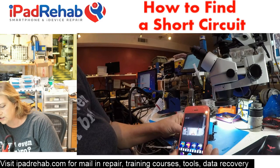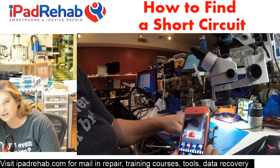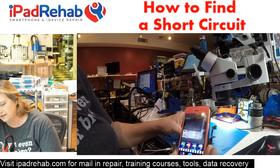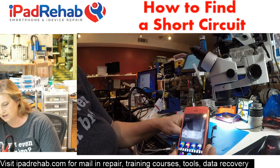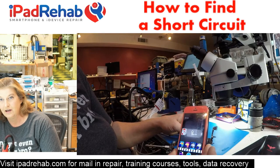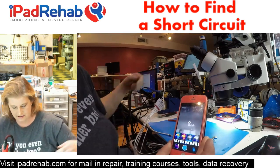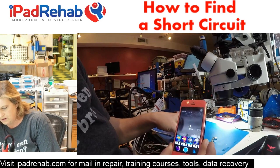Now, if you look at this image, look closely at the board, see the board here where my finger is? That's the board. And see how the heat, the infrared image, is offset a little bit, so it's not quite an exact match. So if there is a red spot here, it really means that on the board it's a little bit further down. And we also could flip this board over and see, are we looking at heat on the opposite side? I'm going to do the exact same thing again. I'm going to turn on DC power and prompt it to boot, and then I'm going to pick this up so that you can see it.